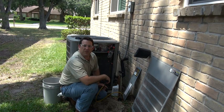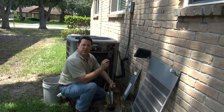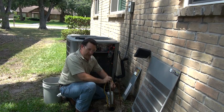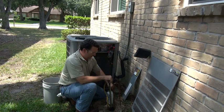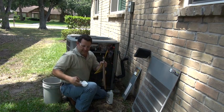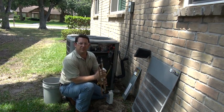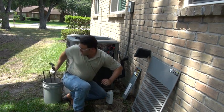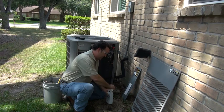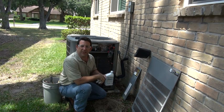Thank you, and if you have any other suggestions for videos, please let us know. One other point to note: when done, I'll take the refrigerant hose and put it back into the container so we don't lose the half ounce of Frigitek that's in the line. Once we've completed this step, if this bottle is not going to be used anytime soon, we want to purge it with some nitrogen. A typical HVAC installer should have dry nitrogen on his truck — it's very inexpensive — and when we do that, it protects this oil because it's very hygroscopic. It protects it from getting any kind of moisture contamination. Thanks.